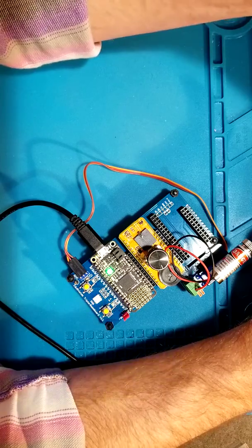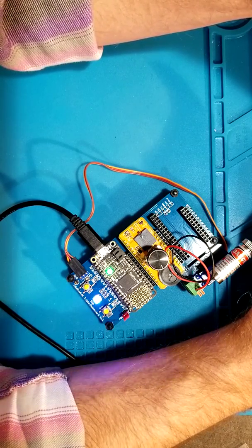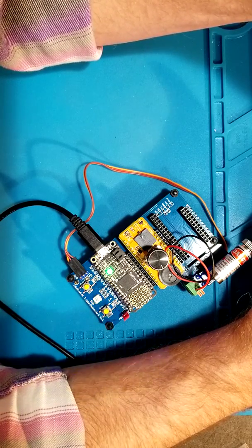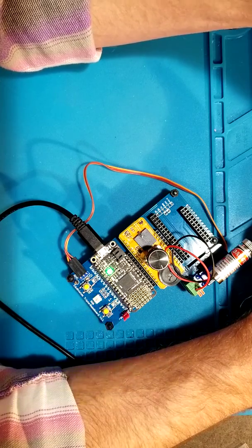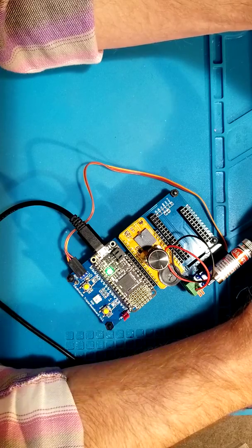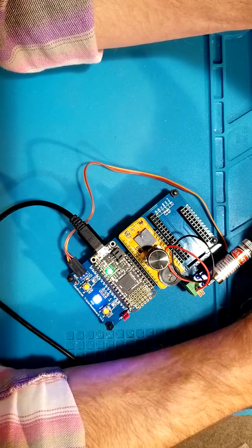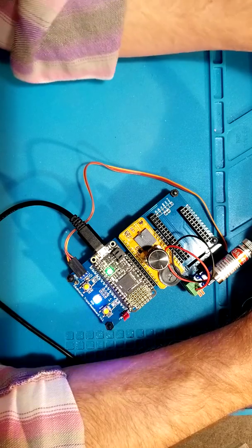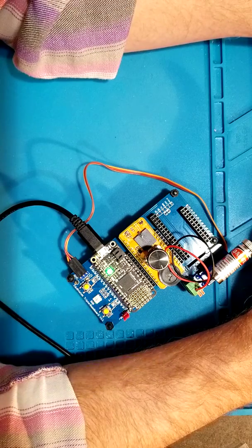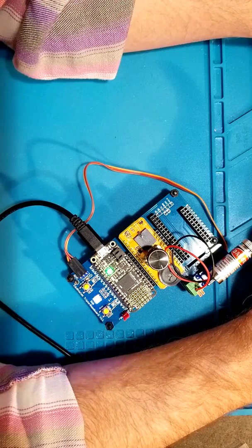We need to have all these files that are listed here in the CIRCUITPY root volume, in the root directory of the CIRCUITPY volume. So if there were a directory between here and these files, it is not going to work. If that happens, take all these files, move them up into the CIRCUITPY volume, and then go back up into the CIRCUITPY volume, and you should see everything just like we're looking at here. So you've updated all the software that's on your Feather board. Well, not all of it, but all the code we'll be writing is on the Feather board now.